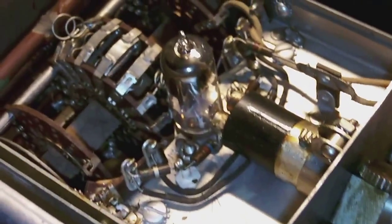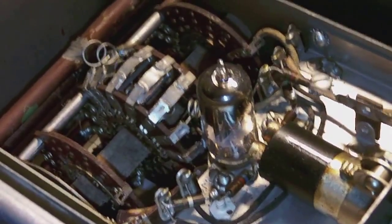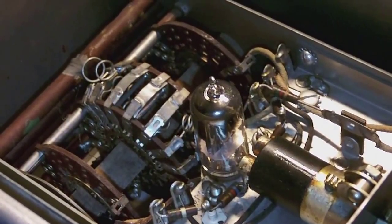Now, this is where I have a problem. My marker generator, my Heathkit marker generator, is incapable of generating continuous markers. I suppose I could have tried to inject a variable signal via my high frequency generator into the marker generator, and that way try to generate a continuously changeable marker, but I noticed I did not have enough pigtail cables to do that. So yeah, that too is a problem. It gets a bit complicated.